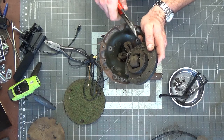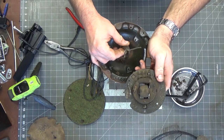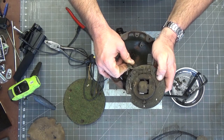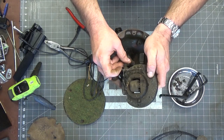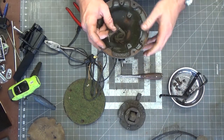One little trick I use when I undo wires: I cut them at different lengths. That way, if I need to recreate or remap my steps, there are only so many possible ways this can go back together. In this case I know the long lead will go to this side and the short lead will go to this side.